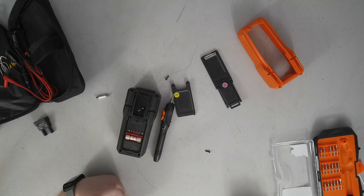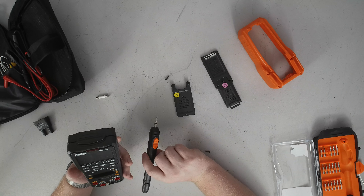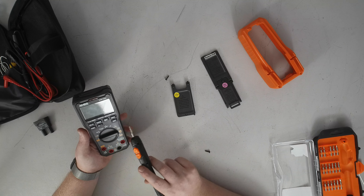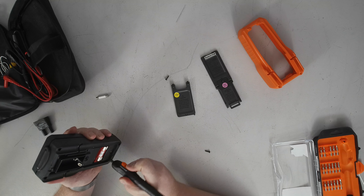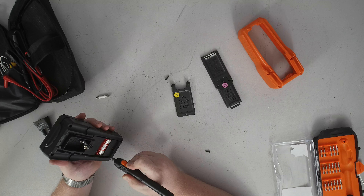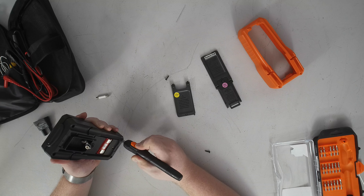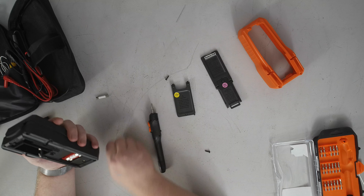I like seeing multiple fuses. The max is 600 milliamp fused, and max 10 amp fused every 30 seconds, maximum 30 seconds every 15 minutes. I like having independent fuses and I also like that they're relatively easy to get to — just two screws to access the fuse housing. I would have liked if the smaller fuse was marked, but that may simply not be up to them.